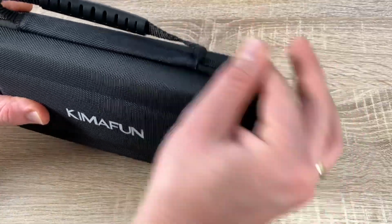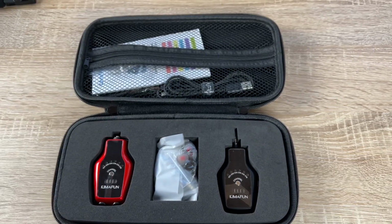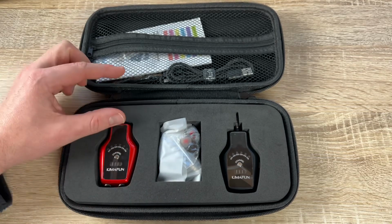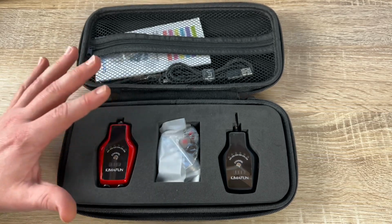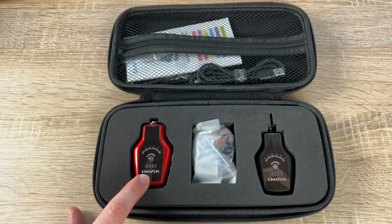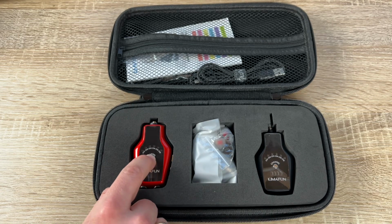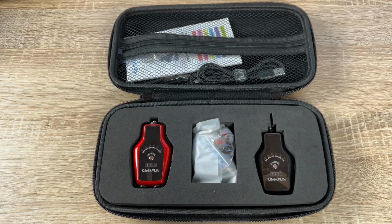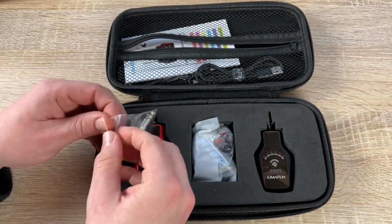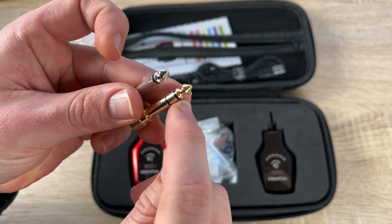That's cool. On the receiver, we have a power switch. On the transmitter too, we can turn the switch on or off with this button. The transmitter and the receiver are powered by a built-in lithium battery. The transmitter adopts a silver 3-pole 3.5mm, a 1/8 inch male plug. We have the channel indicator light on both. The indication light can show the current channel and pairing status. We can use it to know whether the receiver and the transmitter match successfully. And we have a channel switch button.